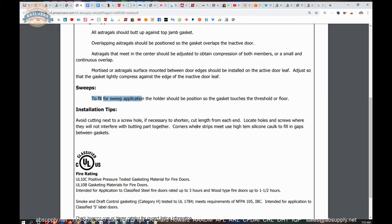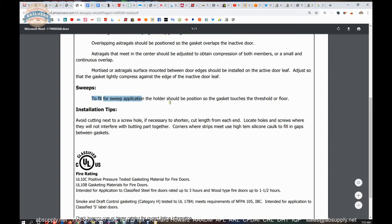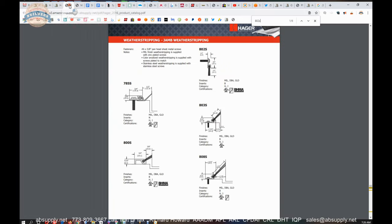Cutting the material — there are actually three different materials involved here, not just two: aluminum, nylon, and steel. The steel is what holds the bristle together. The point of that is: don't run this through your 80-tooth miter box saw. You're going to see some sparks when it hits that steel, and you don't want to lose teeth on your blade.